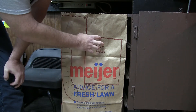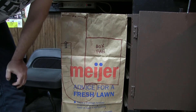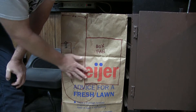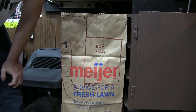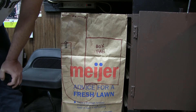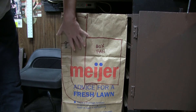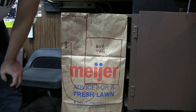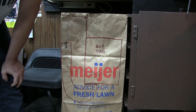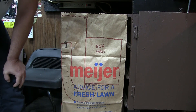It should have been easier — I was hoping the exhaust port was on top so the tubing would be visible from the attic, which would have made it really simple. But I wanted to show how I got this done since I couldn't bring the camera up — too much dust and fiberglass blowing around. So that got attached, brought up with the increaser to four-inch insulated, up over the roof vent, and now we're done. We have a proper bathroom vent exhausting out the top of the roof instead of under the soffit edge, solving roofing problems that had been going on for decades.